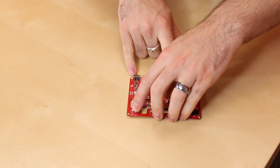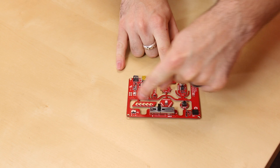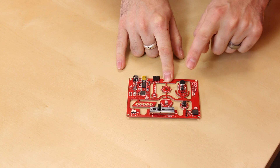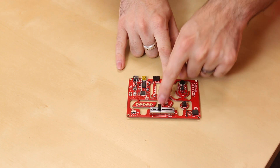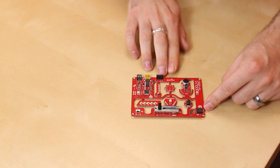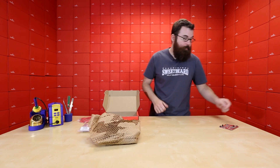We've got a digital switch, which is just an on or off. We've got a little LED bar graph, a temperature sensor, a light sensor, a microphone, another button, an RGB LED, and a slide pot. Over here, we have a three-pin header to connect to other various sensors, so if you want to go a little bit beyond this, you can actually connect some external stuff to that.